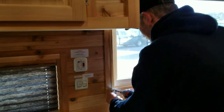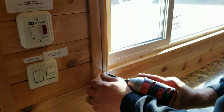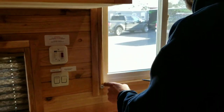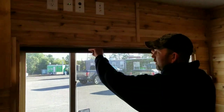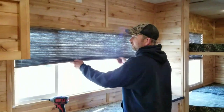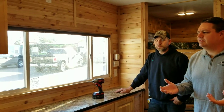That one might be a little tight. You just loosen up your screw, readjust your string, and tighten it back up, which tightens the string — and there you go, looking pretty good. The nice thing about these blinds is definitely the fact that they don't bounce around. And with the adjusters, you can adjust them because not everything is going to be exactly in the same spot. Pretty simple to do.